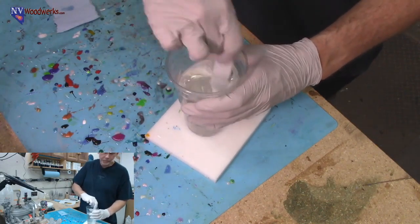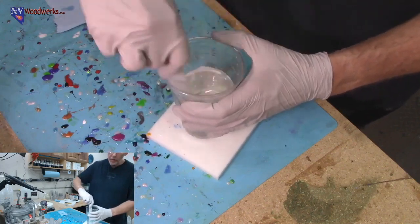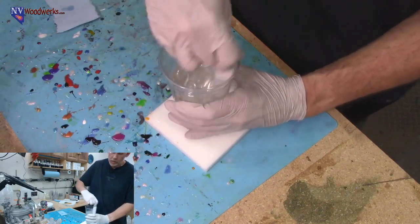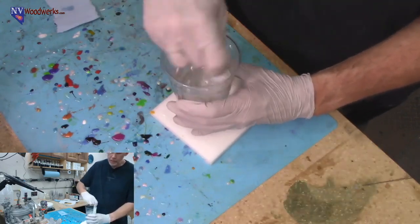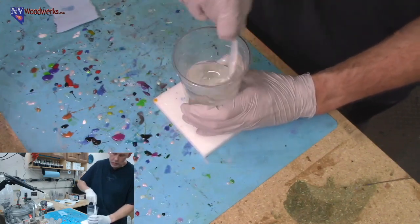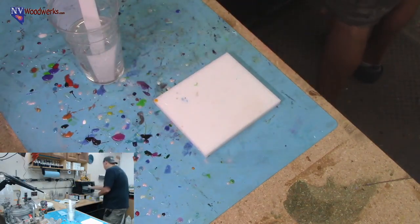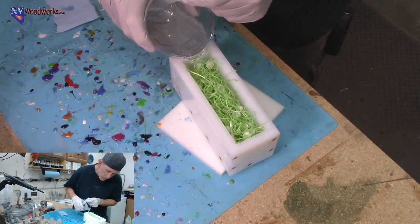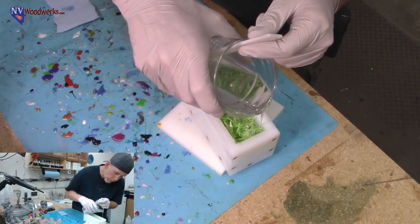With Alumalite clear, if you're seeing some kind of hazy trails or wisps in there, then it's not mixed up fully. It should be dead clear, and you'll see some little champagne bubble-looking things, but it'll basically just look like a seltzer. Give it a good stir for a couple of minutes, then we're going to pretty much just dump this right in. Our mold is warm, and I'm just going to pour it in slowly, getting everything covered and letting it flow up and around everything.